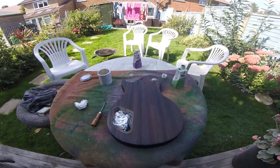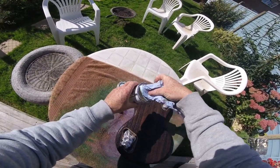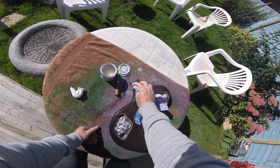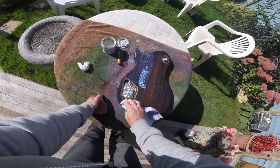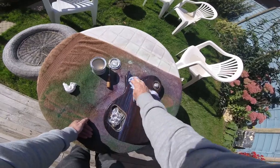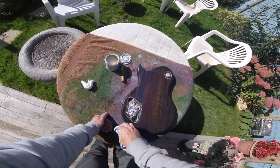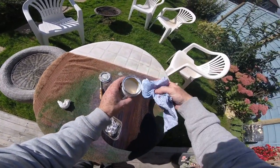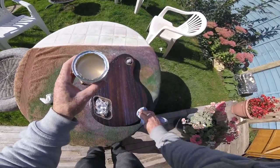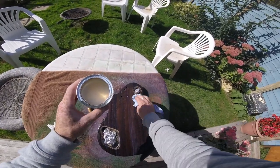Then lots and lots of coats of acrylic varnish, just working it on there with the rag, getting it right into all the grain. I think I did about eight coats of this. It dries very fast so you can keep recoating - it's just something you get from the hardware store, it doesn't have to be anything spectacular, but it just seals it all in and makes it more durable, otherwise it will just rub off on your clothes. You could clear coat it if you wanted to, but I find this works really well when I do the burn effect on the guitars.